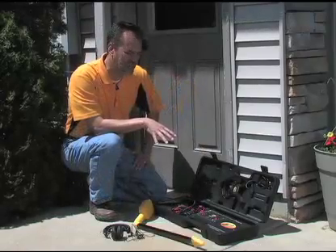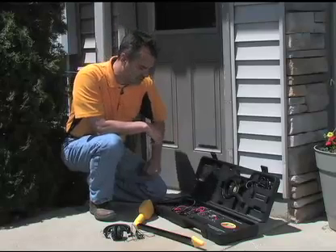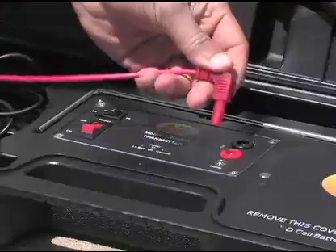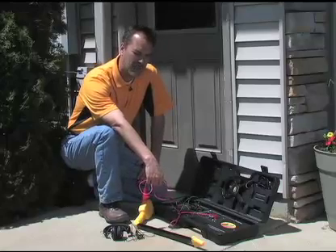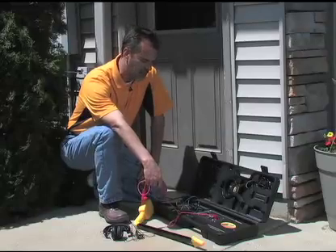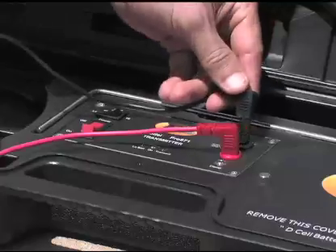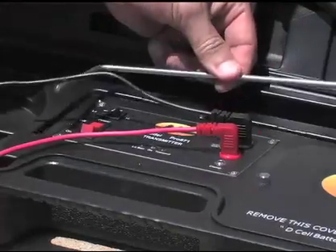Once you're comfortable with your 871, the next thing is to set it up for a locate. First, connect the alligator clip leads — the red and black leads. Each one has its own port, so connect the red lead into the red port. These are standard multimeter connectors, so if you ever need a replacement, they're easy to find at a local Radio Shack or any multimeter cord supplier. They're also detachable so if one goes bad it's easy to replace — you don't have to send it in for repair. The black lead connects into the black port, and we're going to use that for connecting to our ground stake.